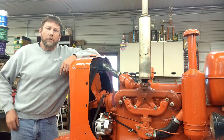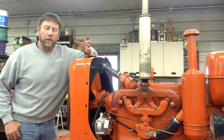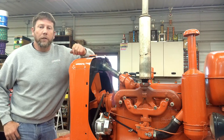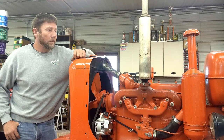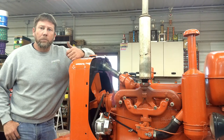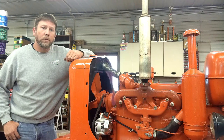Overall I'm very happy with today's events — the tractor did run good. I think I'm going to put a timing light on it. I guessed the timing close enough to get it to fire up and it seemed good, but if there are timing marks on the flywheel there's an inspection cover underneath you have to take off and shine a timing light up in there to make sure it's set right. I've got a feeling it's going to be pretty close. Other than the finish painting, mechanically I believe it's done. Make sure you hit that like button, share it with your friends, subscribe, leave comments down below. Stay tuned for the next video when we get this buttoned up and actually finished. Catch you next time.